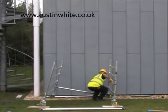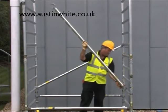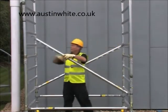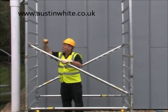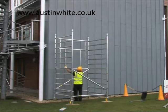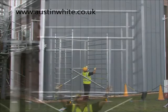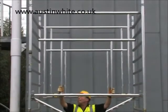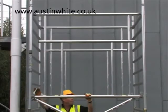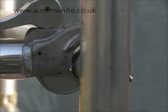Safety and ease of build start at the base. Using horizontal braces for ease of leveling combined with diagonal braces to provide rigidity, one man can build up to the first level without assistance and without leaving the ground. Lightweight and easy to handle, the Camlock Advanced Guardrail locks positively into place and tensions the tower structure by pulling down on the top horizontally.